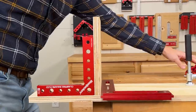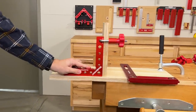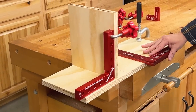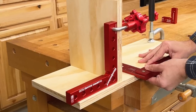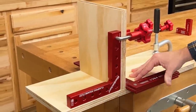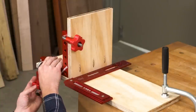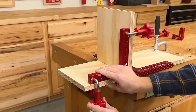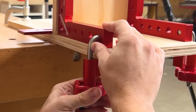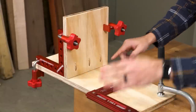To get started with these, we can just plop them in right there and tighten that down. Now this piece can move freely and we don't have to worry about it tipping. With our CSP on, all we have to do is bring our 1281 over to the line where we want the edge of our plywood, butt that up right there, slide it up, and make sure it's flush. Once it's flush, we add in our other CSP right down here, tighten it up, and throw another CSP over here as well. Now it's all locked up and secured perfectly at 90 degrees, with the edge right on our mark.